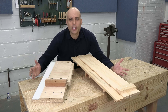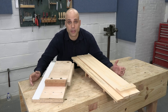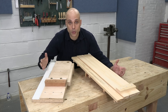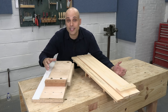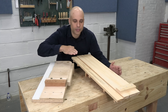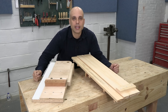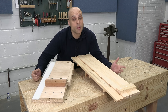So what's the real difference between these two designs? The modern one kind of does everything for you. The plane is held perfectly flat and square, and it can only go back and forth in a straight line. The fence is perfectly perpendicular to the track, so you can only get a square edge — you're kind of a robot, just moving the plane back and forth. The classic shooting board requires more skill to use. The track is going to hold your plane flat, but you have to control how straight it's going and make sure you're getting that perfect perpendicular end. The jig isn't going to do it for you. With this design, you have to develop your skills, your eye-hand coordination, and your control over your tools. This one's going to make you a better craftsperson.